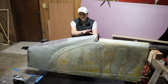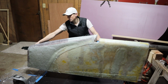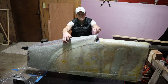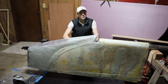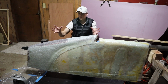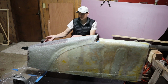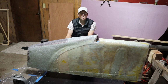So we extended the rudder. It's about 12 inches deeper. And then there's also, probably from here to here, a little bit more area in front of the center of the rudder shaft, which will actually help balance it a little bit better. So overall it got bigger. It's a little bit more balanced, but there's also more area, so it should even out from pressure on the helm, since that wasn't too bad.